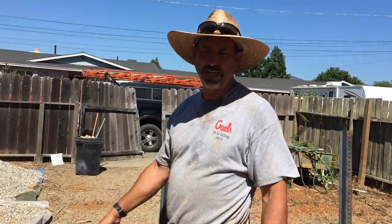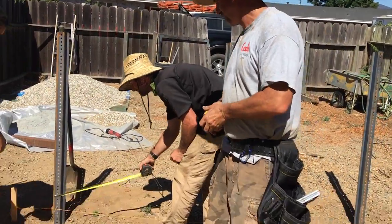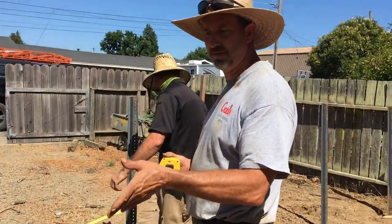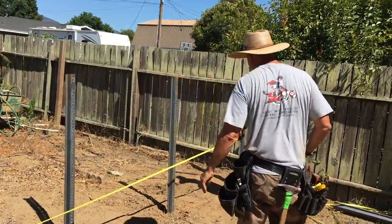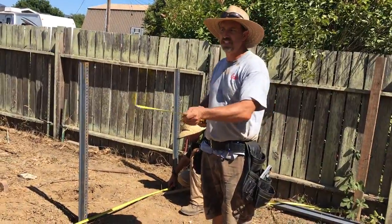Here we're going to go 4 times 5 because when you do a square point, you go 3, 4, 5. So now at that same point, this is 4, so 4 times 5 is 20. We're going to get a line to 20. This line isn't set yet — we already set it. But now you go to the 15 line.